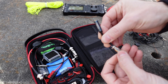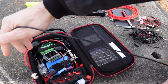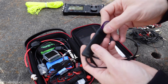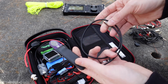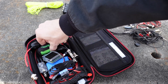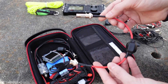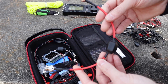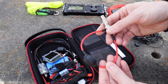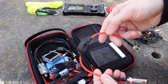I've got an adapter for my key. My key is a touch pressure-sensitive key — I forget the guy's callsign, but I'll put a link for it. Super simple and small packable. I also recommend the N6ARA Tiny Paddle; I normally have one of those in here as well. I've got my Weaver Throwline, which goes with the throw weight. And I've got a coax jumper with a built-in choke — 25-plus dB of attenuation on common current going on the shield. These are in the shop as well, and I'll probably make them available with the red coating too.